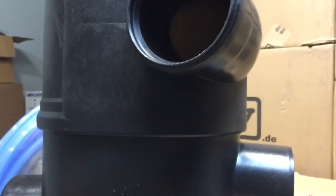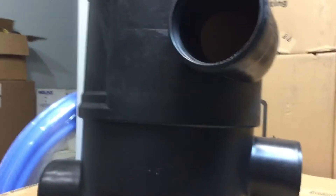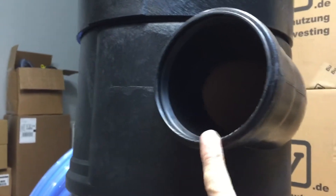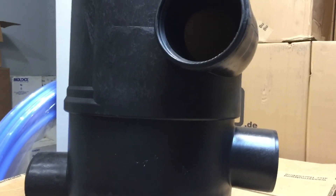You have to account for that drop as you're digging your drainage trench. At that point, you can use a rubber 4-inch FernCo, or no-hub adapter, to adapt your pipe to carry it into the cistern. Again, 7½ inches from the bottom of this point to the bottom of this point — that's your drop in pipe that you have to account for as you're excavating for your drainage and for your tank, if you're putting in an underground system. Thank you very much.